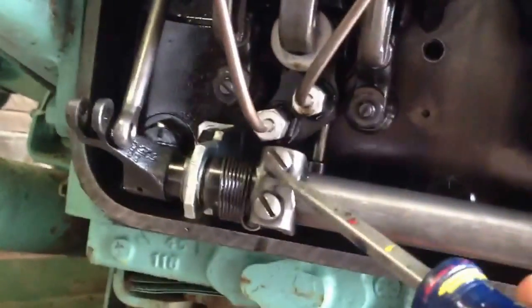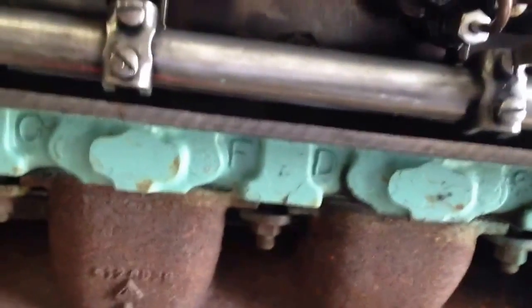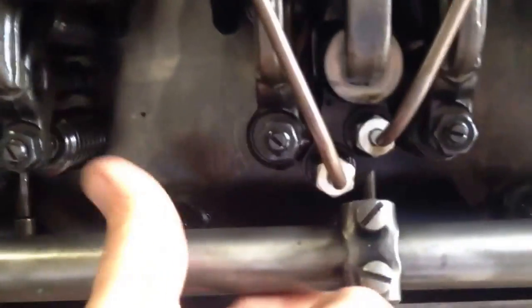To figure out which injector is stuck, I start at the end here and loosen the control. I've gone through and done this — if I loosen this one here, you can see it still doesn't move. I can take it back and forth, it's not moving. Then I go to this one and loosen it, and now my rack will move, but that one is staying still. That is the problem. The rest of these will move full travel, and this one is wedged. So I've identified which one is stuck.